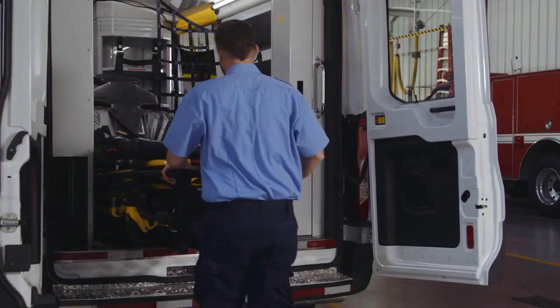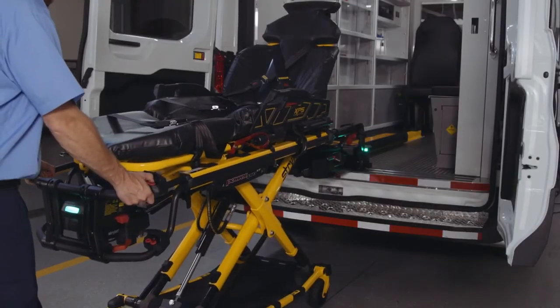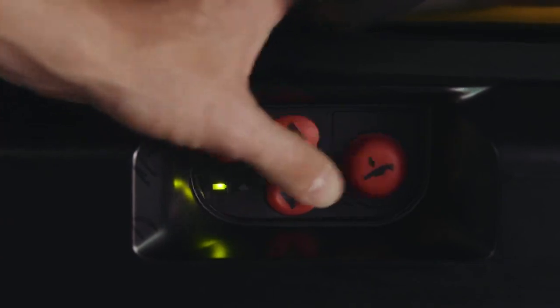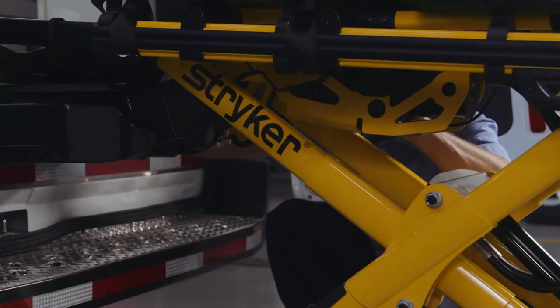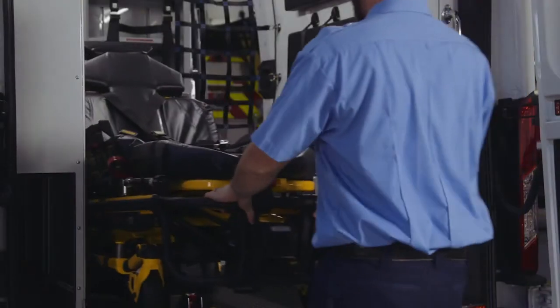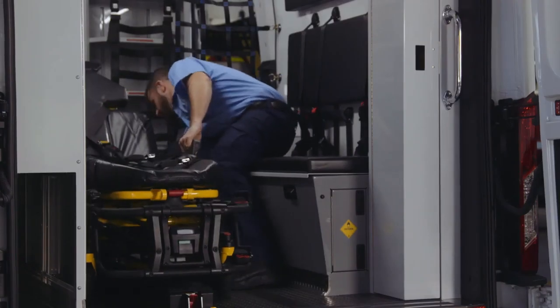The second scenario is the trolley and cot getting stuck halfway out when loading. To handle this, check for debris in the transfer trolley and remove it so the roller will spring up. Pull the cot and trolley all the way out of the vehicle to reset; the trolley will then lock into place. If there's no debris in the transfer trolley lock, pull the patient left transfer lock trigger and load the cot into the vehicle. The third scenario is the cot will not release from the trolley in the loading position and the error LED is illuminated. To handle this, firmly press the manual release button on the Power Load control panel to release pressure in the hydraulics. Press the extend plus button on the cot or the down arrow on the Power Load control panel to lower the lifting arms, then remove the cot from the trolley. Note: you may need to apply pressure to the lifting arms while pressing the manual release button to lower the lifting arms completely. The fourth scenario is the trolley arms do not lower to lock the cot into the transfer when loading. Firmly press the manual release button on the Power Load control panel; the cot will lower and lock into the transfer.